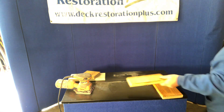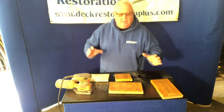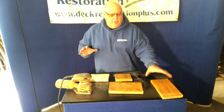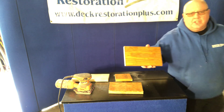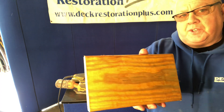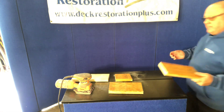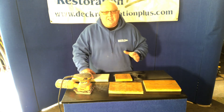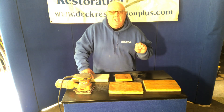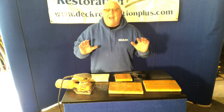So the best thing to do is: clean the deck, sand the deck, get it all prepped up, everything ready, looking uniform and neat, so that when it's done it looks even. You either sand everything so you don't have the spots — which is a big task — or the big key is: sand the spots before you begin to pressure wash, to clean, to stain, whatever you're going to do. Do it first, not last. A lot of people make that mistake.